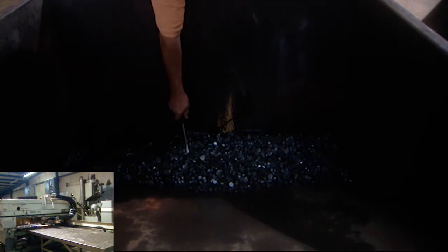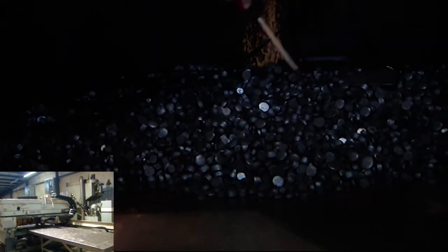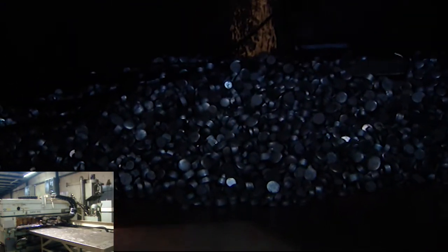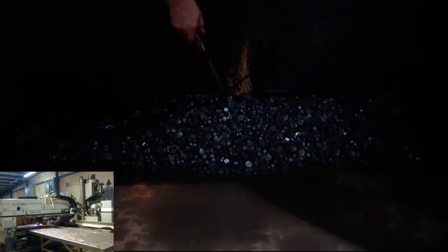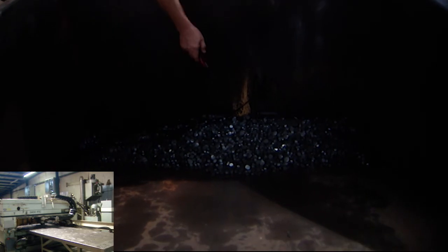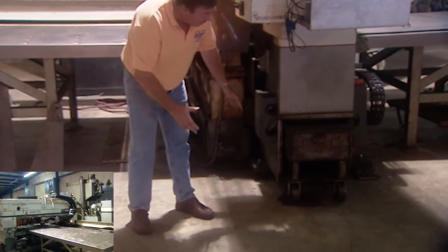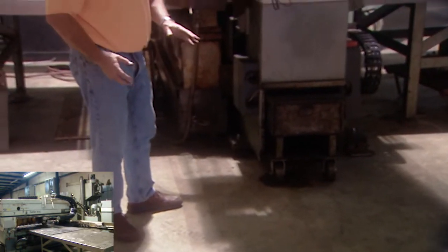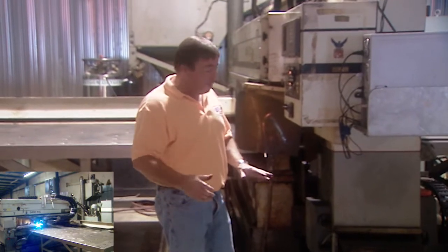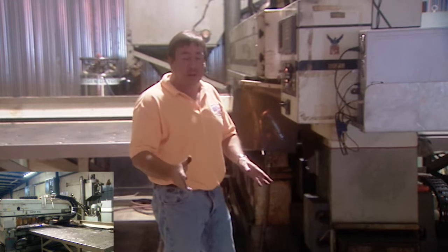Okay, so this is an example of the punch plugs that vary in size that we use from 3/8 to 1/2 inch, some of it's quarter. This is a lot of weight. It's got a big compartment underneath it. We'll show you where that is, and this is going to be emptied depending on how much punching you're doing. This is the bin down here that the plugs come out of. You just roll it out. I recommend emptying it before it gets too heavy to empty, okay? Because the next thing you know, you got a couple thousand pounds of plugs in there, so keep it empty.